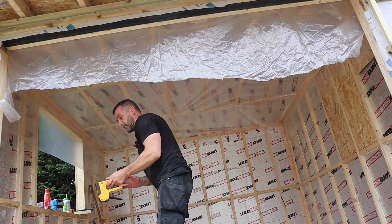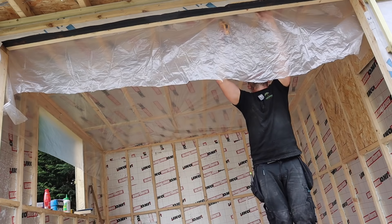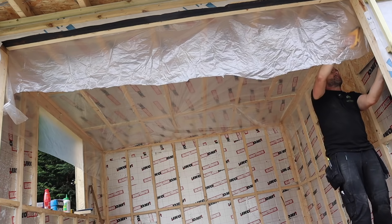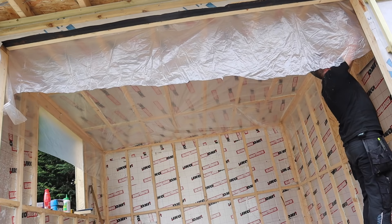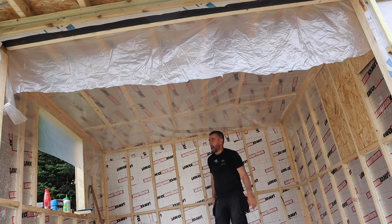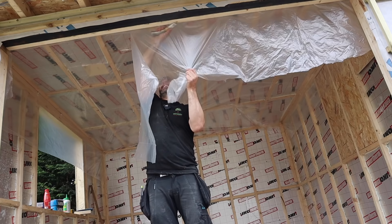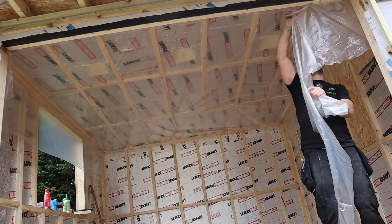On a lot of materials, supply is starting to come through now, but wood prices have gone through the roof — which is slightly annoying because I've priced jobs for the rest of the year and initial quotations will go out the window. I'll have to honour what I've priced — just the way of the world. The roof vapour barrier is completely on. I'll trim off around the doors and then roll out on the floor again for the walls, making sure it's longer than the walls, fix it, and we'll be good for plasterboarding.